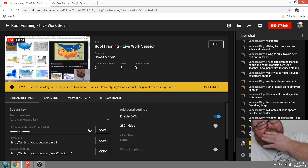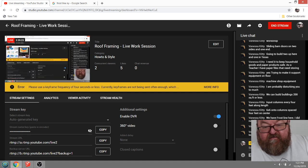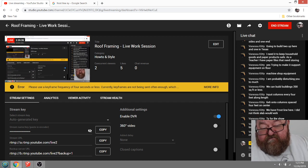Well, but still, if you're gonna dig that many footings for that many columns, you might want to think about just doing a continuous footing all the way around the perimeter. Because if you had a continuous concrete block wall around your perimeter, you could span that 16 feet with 2 by 12s. Just think of how many columns you would have. Would you have 4 times 5? That would be 20. I promise you.